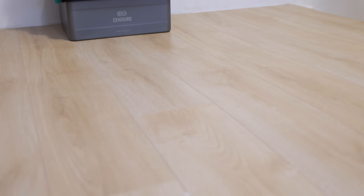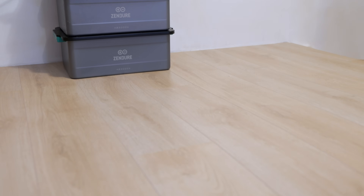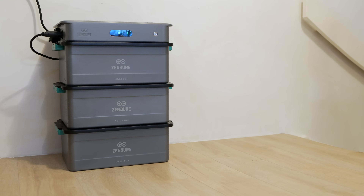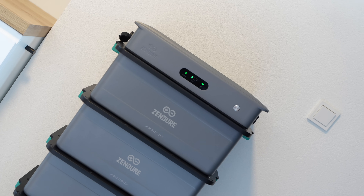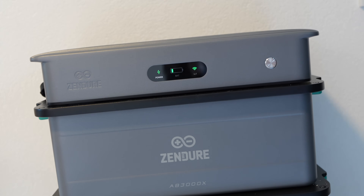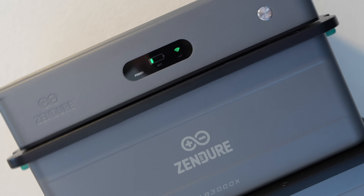In all honesty, after a few days I totally forgot we have a battery system here at home because it just runs quietly in the background and you don't have to do anything. With a larger battery stack, the biggest benefit is not powering everything, but covering long stretches of base consumption. My goal is to store enough solar power during the day to cover my nighttime usage — the zero-on-the-meter goal. This way I'm effectively shifting energy from cheap or surplus moments to expensive ones, especially on a dynamic contract or with low night rates.